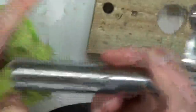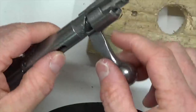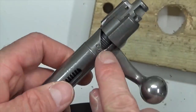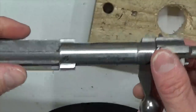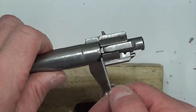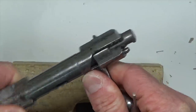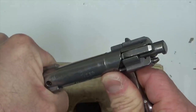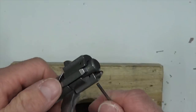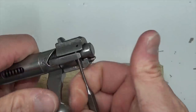I've got some Teflon grease all over my hands here. What I'm going to demonstrate now is what to do if you accidentally drop this cocking piece into the big divot — don't follow what I'm about to do right now, this is just in case something went wrong. God forbid you go this direction — and it's hard to do, you really have to wrench on it. You're going to have to pull up on the cocking piece with your 3/32-inch punch.